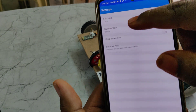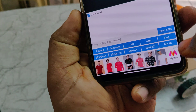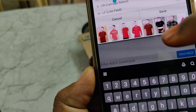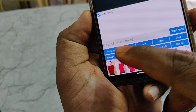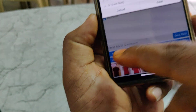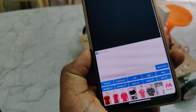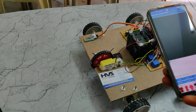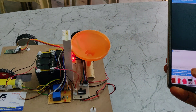In the app's initial setup, set button rows to two rows — it will default to one row, change it to two. The buttons will appear as BTN1 through BTN10. Click and hold each button to configure: forward as small 'f', backward as small 'b', left as small 'l', right as small 'r', stop as small 's', plow on as '1', plow off as '2', seed on as '3', and seed off as '4'.